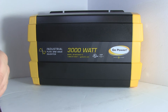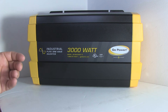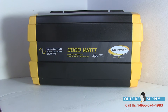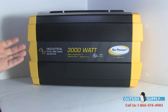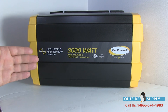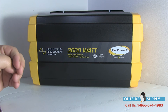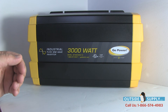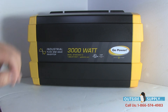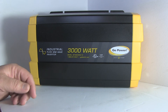Here was one of the questions I got — really the purpose for this video. I have a customer who has a 2000 watt inverter need, but they require that it be hardwired; they cannot use the pigtail. The answer is really simple: buy the 3000. That's your answer. You want that direct hardwire connection, and you want to make sure this inverter has the UL listing — and that is one of the requirements. Go ahead and upgrade to the 3000 watt.